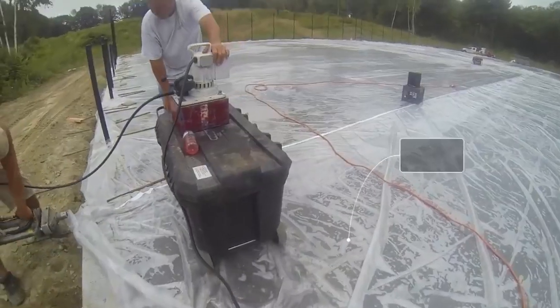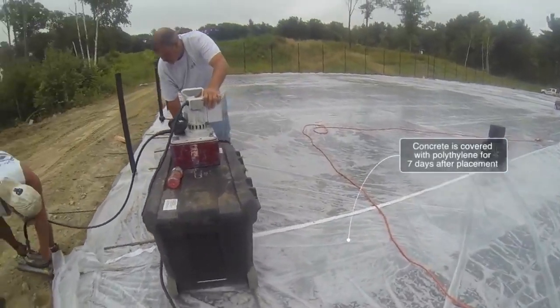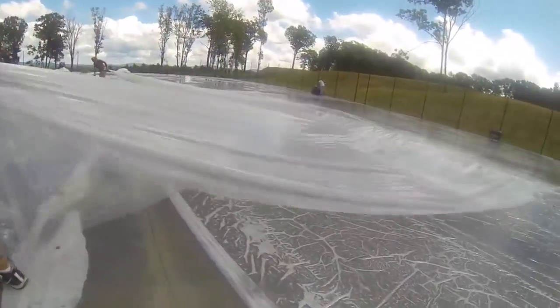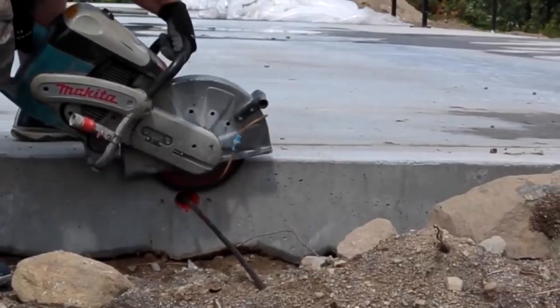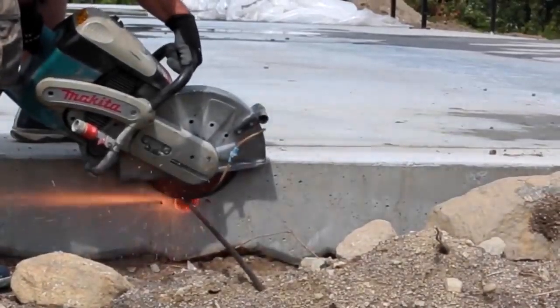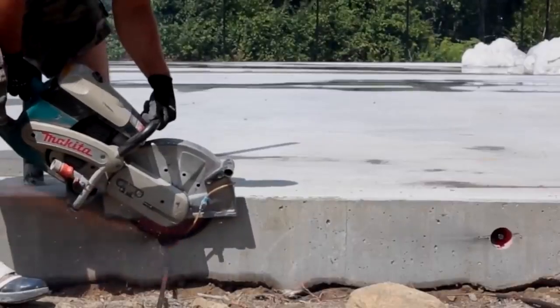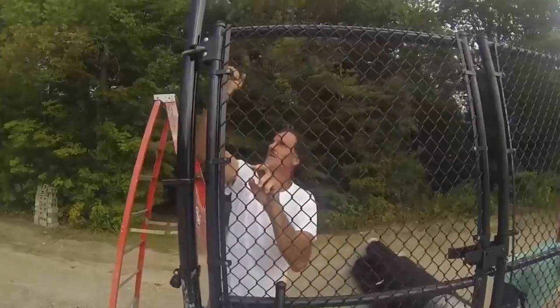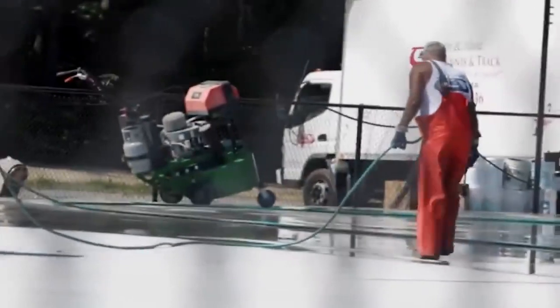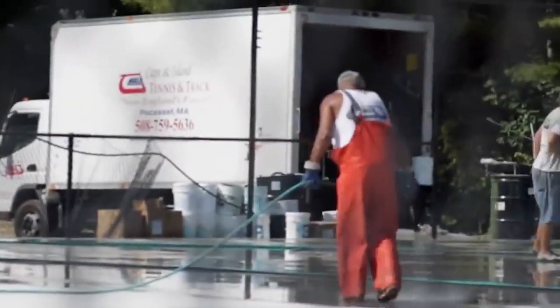The court is poured with concrete and flattened out, and a week later, when the surface is hard enough, they proceed to the construction of the fence. It usually doesn't require any specialized equipment. Later, at least 28 days after the concrete placement, the surface is ground and prepared for primer and paint, coated with a special emulsion and waterproofing.